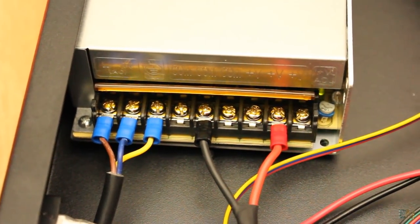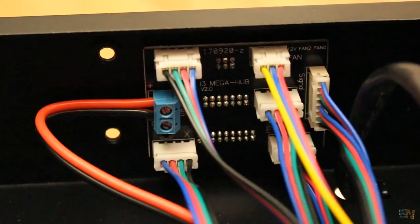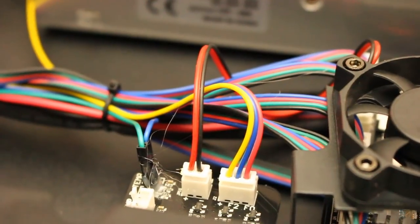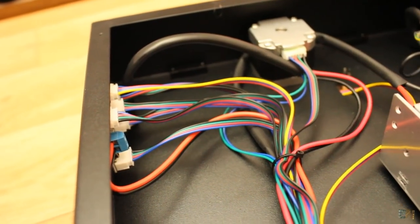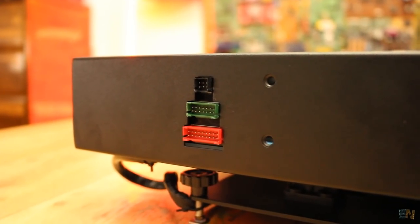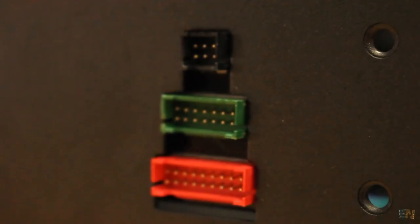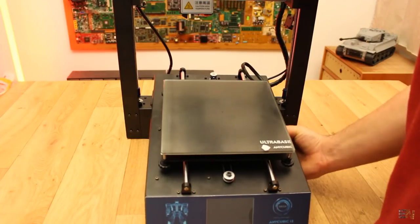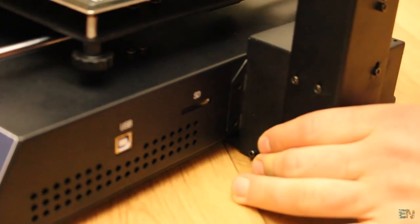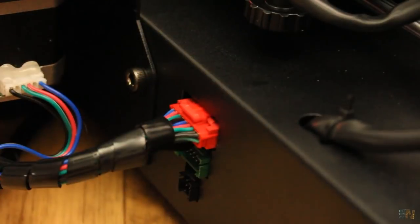All the wires have decent connectors and insulation. We have the touch screen module here, the SD input, and the connectors for the motors and the end stops — which is the next nice thing about this printer. Instead of wiring each end stop, each motor, and the heated element separately, you have 3 different size and also color-coded connectors for everything. Since they are different sizes, you can't put them in wrong. Now you have to lift and drag the bottom base of the printer between the top frame and fit it in place, so you are able to secure it with a set of 4 screws on each side. Now all you have to do is connect the color-coded connectors and the printer is ready.